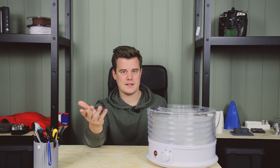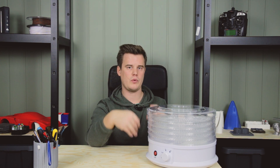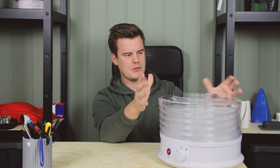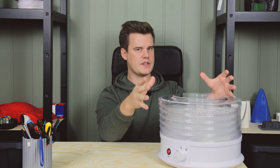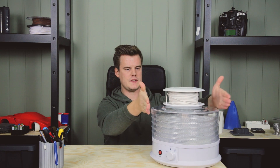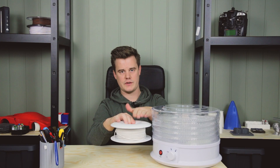The timer is not an exact science and I don't have all the answers, but if you Google around you'll find good material on how long to dry different filaments. Also make sure you go for a round version — it's much more efficient with space — and you want something that is much bigger than your spool. With this spool you can see I have a lot of clearance for air moving around, both on top and around the spool.